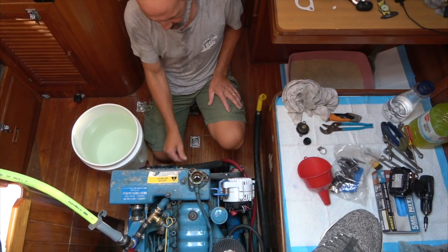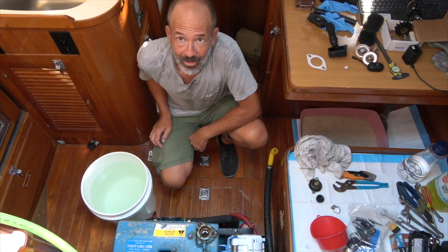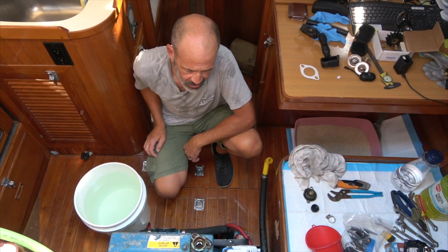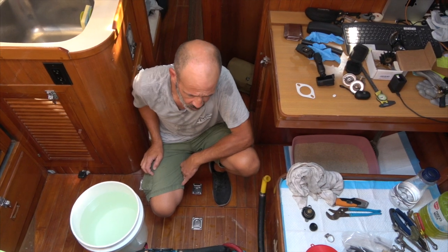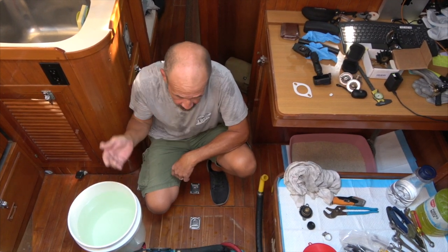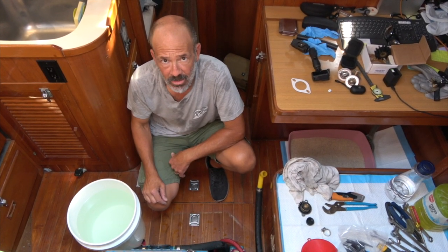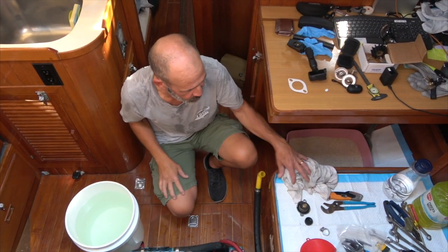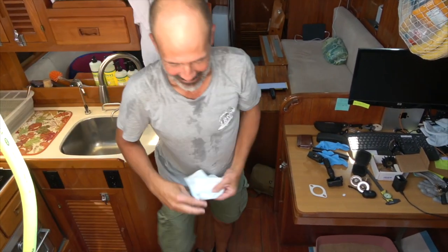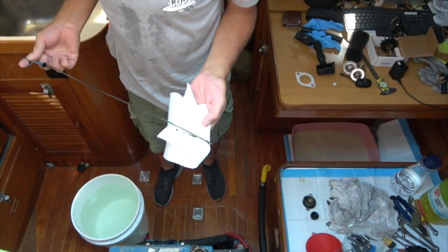This is the Perkins low-line model with the header tank on the front. Do you think running the engine and having it overheat did any damage? I hope not — diesels are pretty tough and Perkins are tougher than hell. I don't think we got to the point of scoring cylinder walls or cracking a head. If we cracked the head we'd be blowing blue smoke or losing coolant into the oil and it would look like milky coffee foam. The oil is jet black, like diesel oil does look — so that's a good sign.